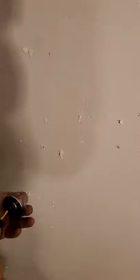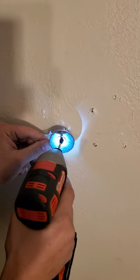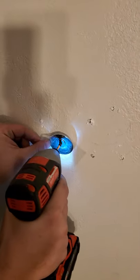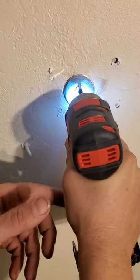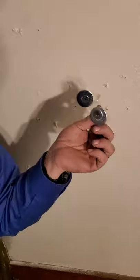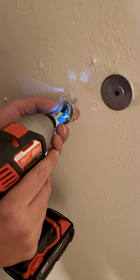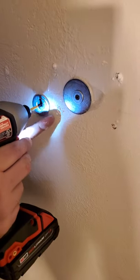Zoom it out a little — okay, you're in the middle. So now we're going to go back to the beginning. Basically I kind of run right around along the crack with these big washers. I have a series of progressively smaller washers. This helps kind of draw it in a little bit to suck the plaster in. I had to use an adapter to make it work. I'll run down here to the edge of this and suck it down. You can feel when it hits that lath — it starts digging in.